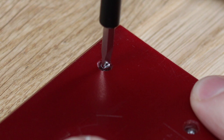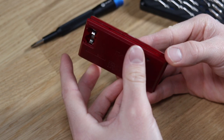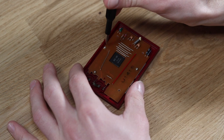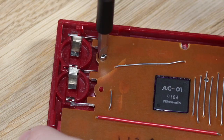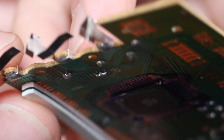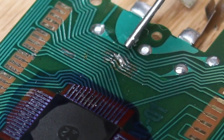The disassembly starts with a flathead screwdriver. The modern Nintendo consoles all use tri-wing screws but Nintendo didn't start using these until a few years later. After that we can slide the back off, and here I discovered I wasn't the first one to attempt to repair this — which is never a good sign. The speaker wires were detached; that's our sound problem figured out. After removing a further three screws I discovered some other issues: there was a hairline crack through the motherboard as well as some exposed damaged traces which were all soldered together in a clump.